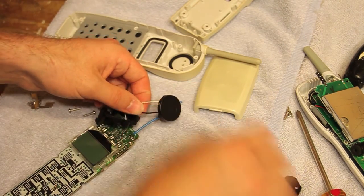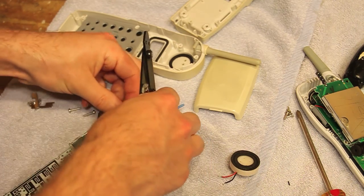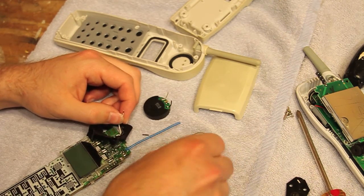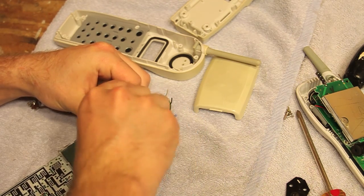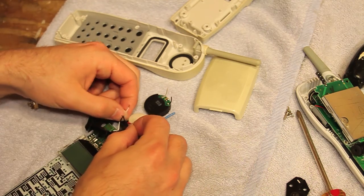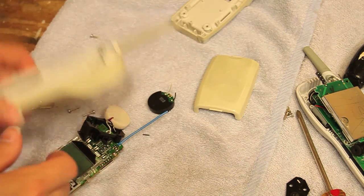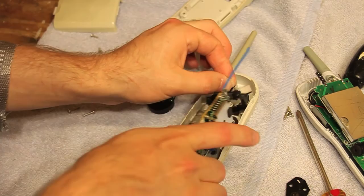So what we're going to do now is I'm going to cut this off and I'm going to strip this. And I'm going to make these connections just enough so I can do a slightly better test with the speaker actually in the handset. I'll just grab some tape to put around these wires for now, unless I can just kind of finagle this into here without it. Of course we have to be very aware of the fact that the wires can't touch each other.